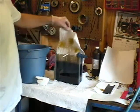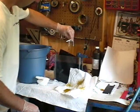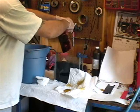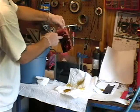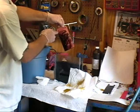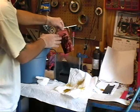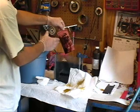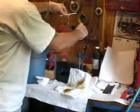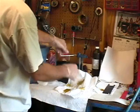It's been about eight minutes — we'll check and see where we're at. You can see the center is etching; that's our little hot spot I was speaking of. The edges are etching a little bit and the copper has really changed color. We want to check it more often now. Once it starts to cut through like this, the etching goes a lot faster. So right now we're going to take and turn the board around to cut down on that hot spot, put it back in, and we'll check it again in a couple minutes.